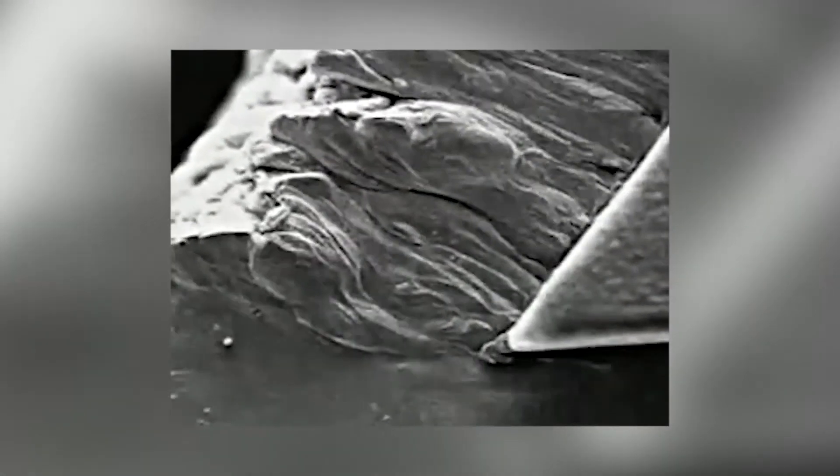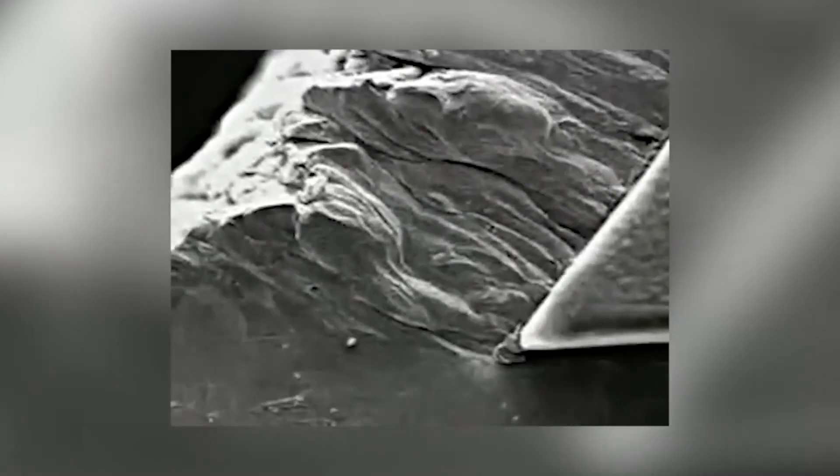At the microscopic level, as you're cutting, pieces of material will gather right at the tip of your cutter. Again, think of it as a knife shearing off the top of your material — the tip of the blade is a collection of that material. Occasionally a piece of that collected material will break loose and escape with the chip. But with bad feeds and speeds, they pass under the cutter and remain on the workpiece.